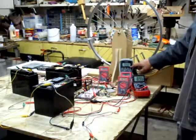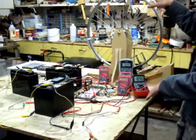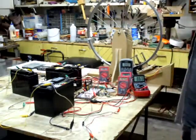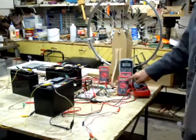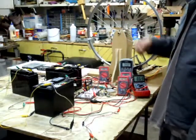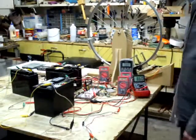This is the other battery that I recovered — it can take a full charge, but it's really low right now because I've been combining both batteries during the charge process. What happens is the higher voltage battery ends up dropping down as the lower one comes up. They sort of equalize and then eventually start charging together. This is showing the charge battery voltage, so it's about 12.45 right now, and that might drop down quite a bit. I've also got a PC power supply I've been running off of when this battery gets low, just to bring it back up.